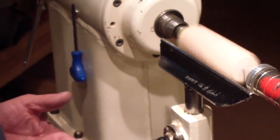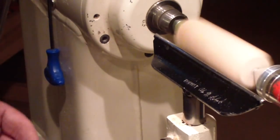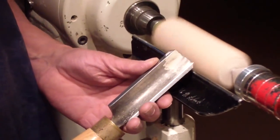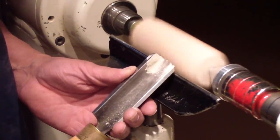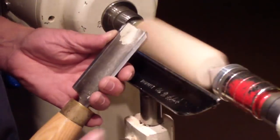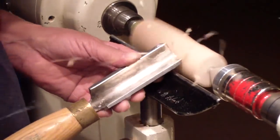Well, this is about 1 inch in diameter, so I can go the fastest this lathe will let me go, but this sounds about right to me. Stuart Batty likes to say he turns it up until he feels suicidal, and then he hits it up another notch. I turn it up until I feel uncomfortable and then back off a little bit. And I'm going to do it a couple inches at a time. I'm not going to start down here and try to plow through the wood. If you're lucky, it's probably more comfortable going the other way.